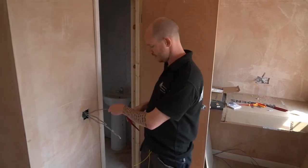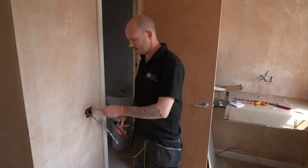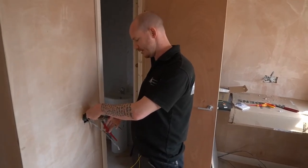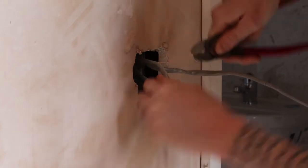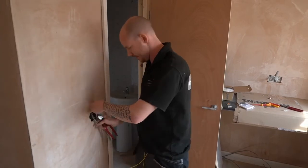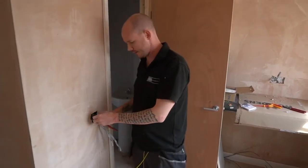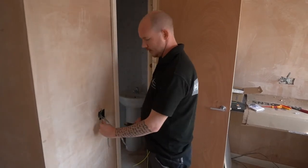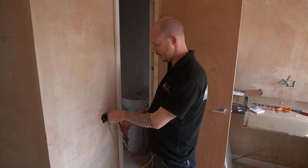I'm going to start by going to the furthest corner and cutting off a centimeter. I don't want to cut off my marking and forget which cable does which. So I'm going to start with my switch line — I'm going to strip it back. I'll strip a little bit of the switch line so I remember that one is my switch line. Quite simple as there's only two here, keeps it easy. Now I'm going to strip up my feed.